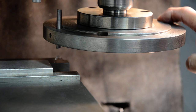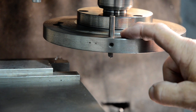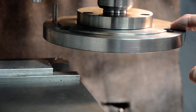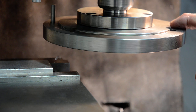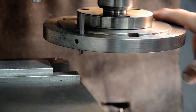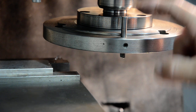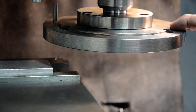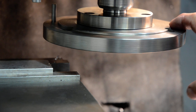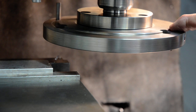This is useful for two different machining operations. One: if I want to remove more material in one pass, I can set that one to take the appropriate amount off and set this one to take an identical amount off, so I can actually remove twice the material in one pass. But where this is also useful: I can set the one that contacts first to take the bulk of the material off, and set this one a small amount lower as a finishing cut. So this one in effect is the initial roughing cut, and then this one will be set to be a finishing cut.